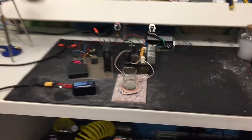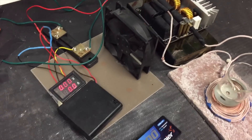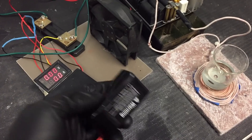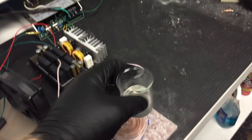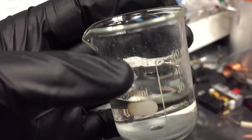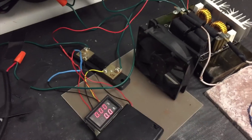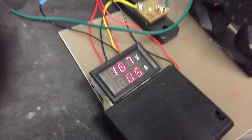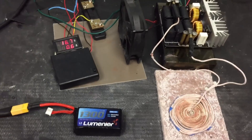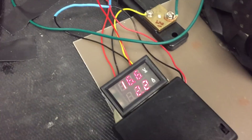This is a first test of a battery-powered induction heater. I have a quadcopter battery hooked up with a power meter, a steel washer, and a beaker. Without anything in the coil it draws only half an amp, and now with a load it's drawing two amps.